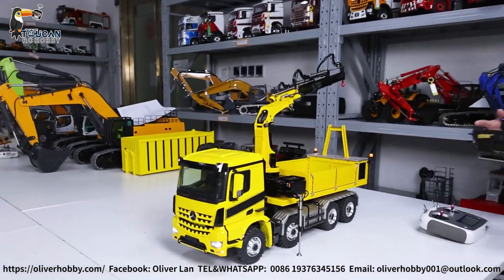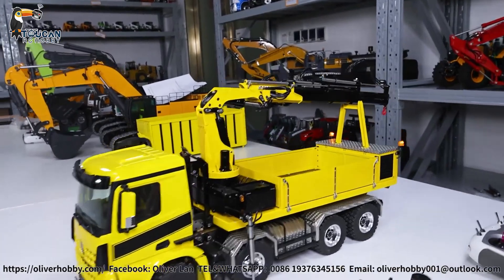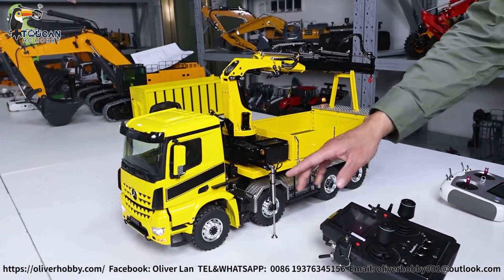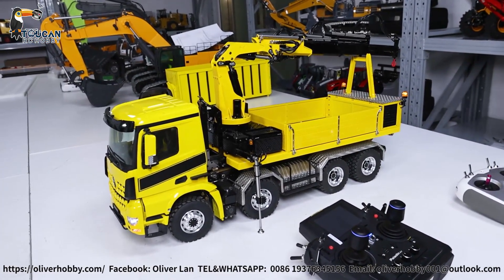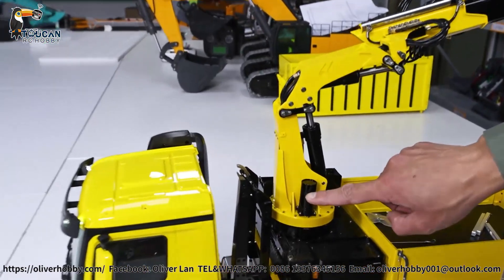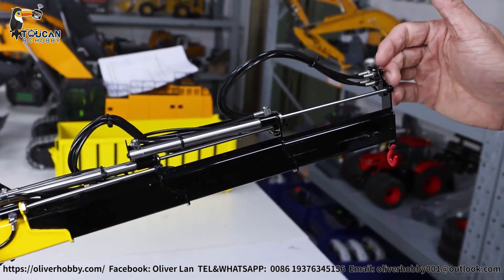Here I have the supporting — let's align it slowly, then drop and secure on it. For safety, after combining, we will combine the operation with one radio and two receivers. Now for the gearbox, for safety it must be in the middle — not driving it — otherwise you are pulling and damaging the leg. So now it's at neutral position. Even if you push by mistake, no driving, no pushing. The arm for the crane is the same used for the truck and rotation. Cylinder for the middle arm, cylinder for the front arm rising, and three cylinders for one, two, three arm-out, to spare a channel for the grab and rotation.